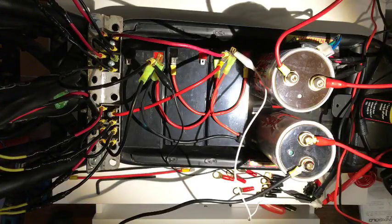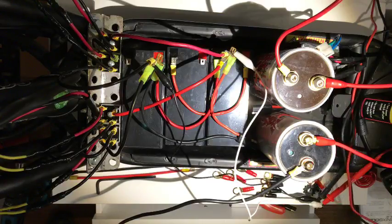Okay, that's interesting, because these were producing 20 volts each, and we tested them individually. I thought we were at 40 volts when we tested them in the garage. Yeah, I think so too. I don't know why the voltage is lower now. Was that with or without bridge rectifiers in place?